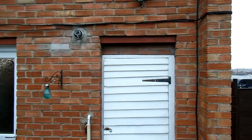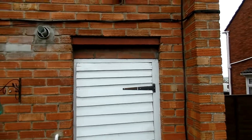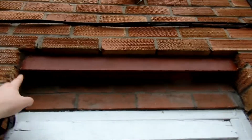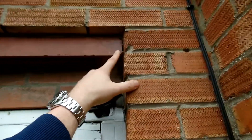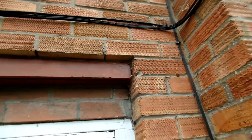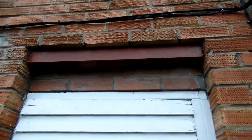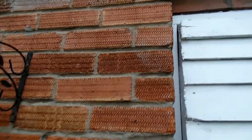What we're looking at here is a mid-1960s property with something called a boot lintel. You can see here it looks like it's almost flying, as it doesn't look like it's built into the brickwork — which it isn't — and you can see there's a gap at the end there. These do have a tendency to shrink, they also have a tendency to rotate, and when you look inside with a thermal imaging camera you can see quite how cold the inner surface is.